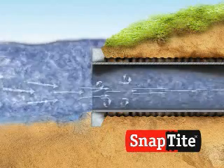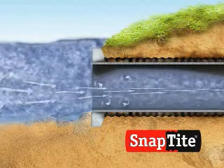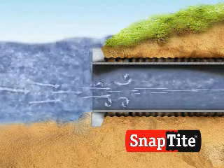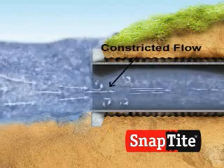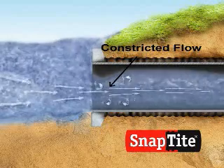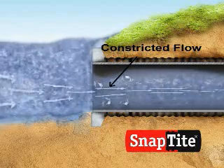However, during heavy storms or full-flow events, water continues to rise above the top of the culvert. When the pipe is full of fast-flowing water, turbulence creates small eddies or counter-currents just inside the culvert entrance. This turbulence actually constricts the streamlined flow of the influent, effectively reducing the pipe area and flow intake at that location. This surface area reduction is typically referred to as a vena contracta.